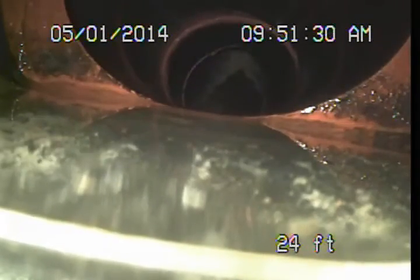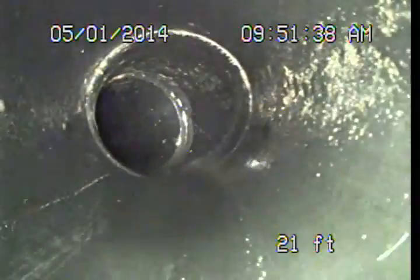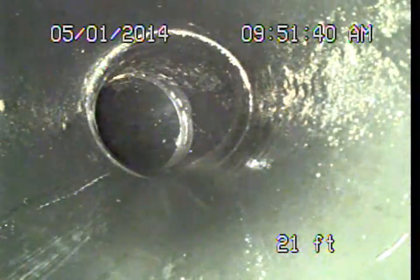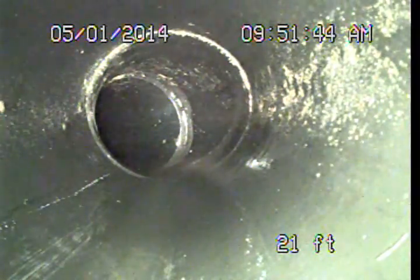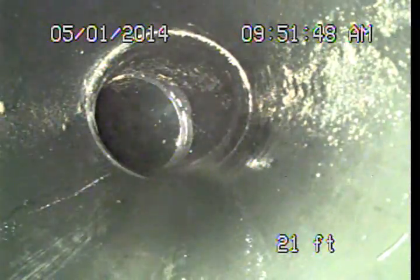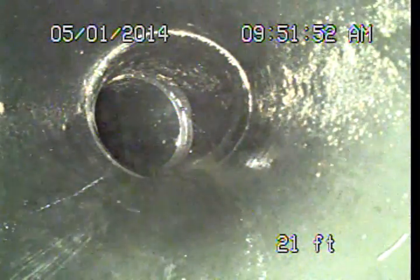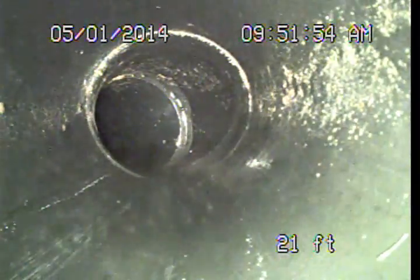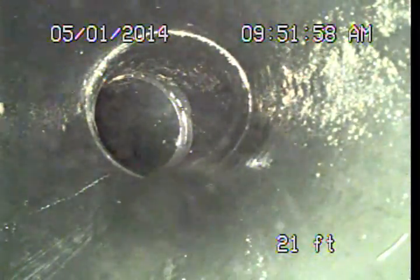Alright, so with that, I'm going to go ahead and wrap up the video portion of the examination. I will be including these videos in my written report, which will describe the final findings and recommendations for today's examination, including the maintenance recommendations, such as the cleaning of the pipe. We also do recommend that main sewer lines should be examined after any significant seismic activity, and that main sewer lines should be examined annually to monitor for changing conditions in the system.